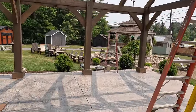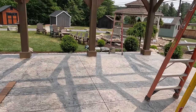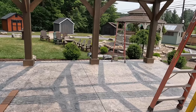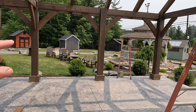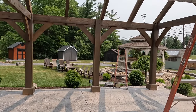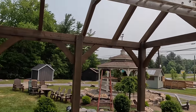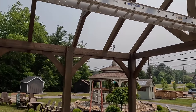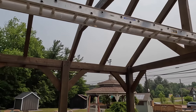And this pad, by the way, is sloped 3 inches from this side to that side for water to drain. So those posts on that side are just a little bit longer, but they bring all the posts, cut everything to length here, make all the notches, everything on site. I did notice the rafters were pre-cut, but yeah, nice fit, nice finish, really nice.